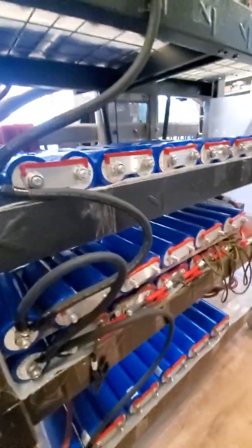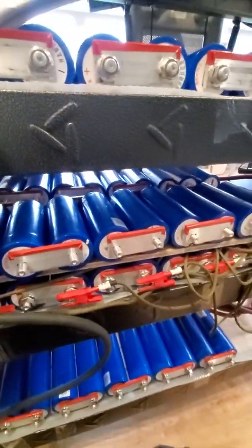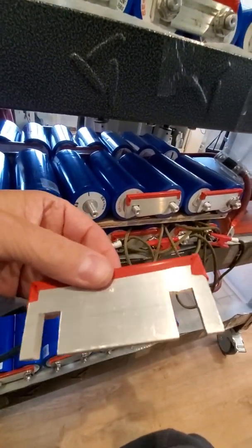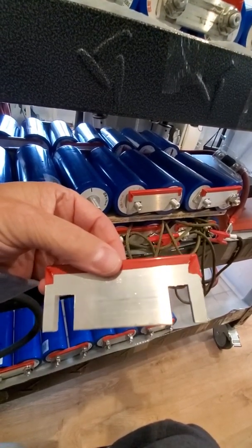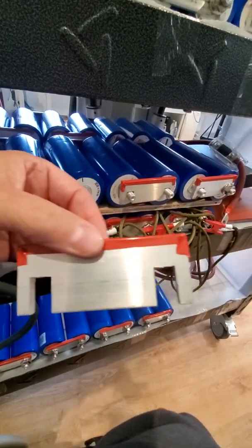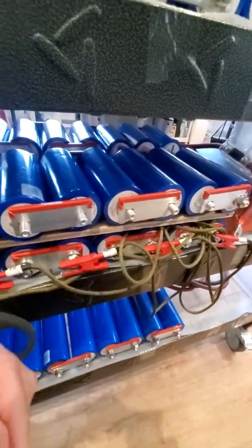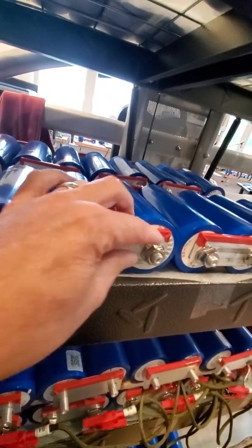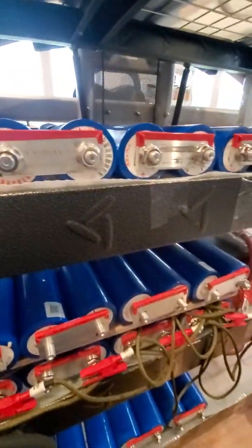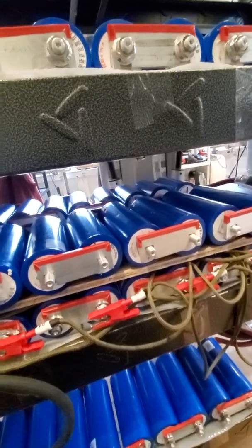The way I connected these — I tried a lot of different ways of connecting the batteries in parallel, but this is what I came up with because it seemed to be the best and simplest. I cut this off of a bar of aluminum, a big long six-foot bar, and made multiple cuts to create the two dashes that you can see there. That just sets right up on the battery, and the nice thing is once you screw your nuts on, to pull it off you just loosen them about half a turn and the thing will pull right off.